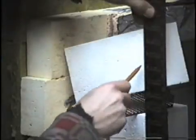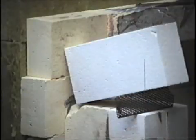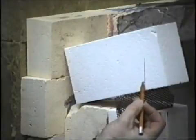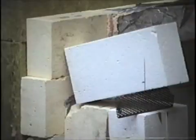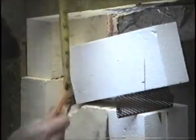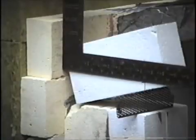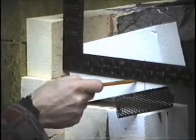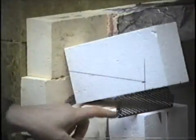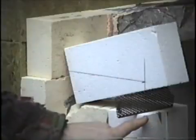The first thing I'm going to do is get a parallel line on the vertical side — that'll be the angle of this little keeper piece that will lock this into position. I'll go up about a half an inch, and that'll be the horizontal line. I'll carry this horizontal measurement through to the end and mark it for cutting. This brick will sit down and lock into position over the edge of this corner.